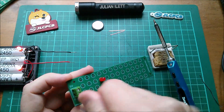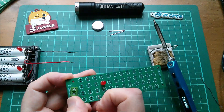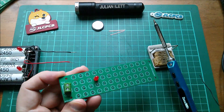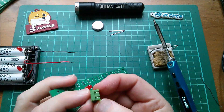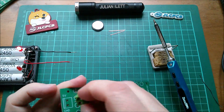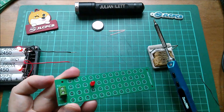Next up, the connector. I really don't like these connectors very much, because there's a tendency when you tighten the screws for the thing to twist around, and when you see them on PCBs they're always twisted like that. If they had little plastic pins or pips on the underside that you could make holes for, that would prevent them from turning.